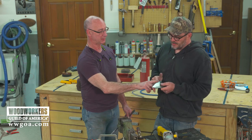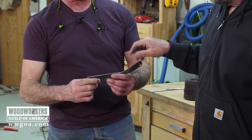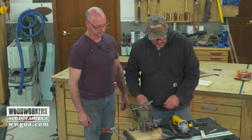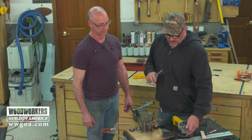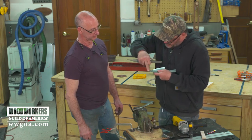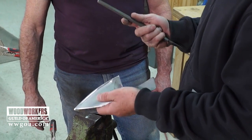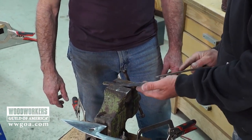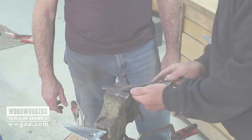Right, because you heat it up faster. Less material here. It's easy to blue it because it's so thin. Right. All right, so I can bring my angle back. And I was giving you this little tip here. I think I was able to smooth this all out because with the tip of the grinding wheel, it's a dimple. You're putting a dimple and you're trying to move that dimple across and then do it all at the same time. And just like using a planer for wood or a hand plane for wood, if you use the file, you can bring that bevel back all clean and evenly.